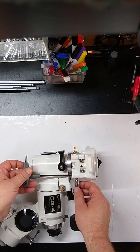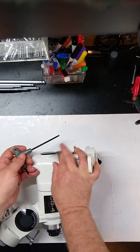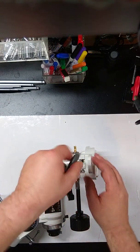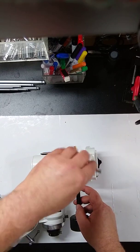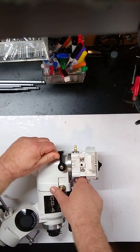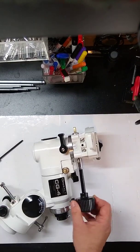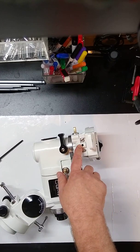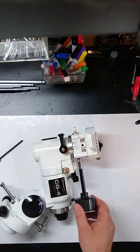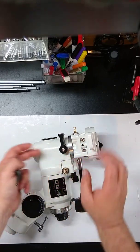The trick here is to take your long screws and just make everything barely snug, so we can see where we stand. We have four bolts — just make them snug. This middle one is loose. What happens now is I cannot turn the worm; everything is bound up. Because the central screw was loose, the housing is now down tight against the worm and I can't spin anything. So we need to loosen it and bring the whole assembly up and lock it into place.